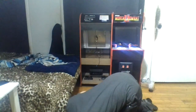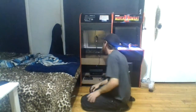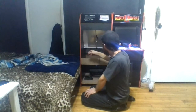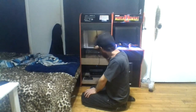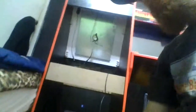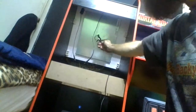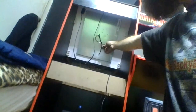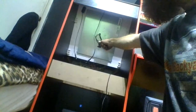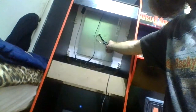You might be hearing thunder in the background — it is. This goes to our marquee, this one goes to our speaker, and that'll plug into the LCD board. This is the power supply right here — this is the red, you'll plug it in that way. This is the ground — you'll have to ground it, probably right there, and then we'll plug in the LCD board.